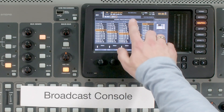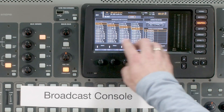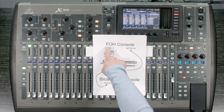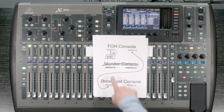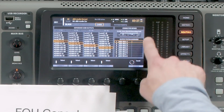The next thing is to get our card set up on this console to output into a DAW or a recording device from our AES50. Tab over to Card, and instead of choosing Local, we're going to choose AES50A 1 through 32. This means anything connected into the S32 is coming into the A port, being routed out of the front of house console into the B port, which goes into the AES50A port on our broadcast console, hitting all our channels and the card — whether that's an XLive card or a DAW connected on the USB port.